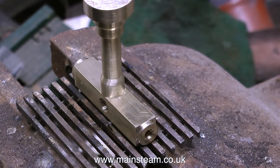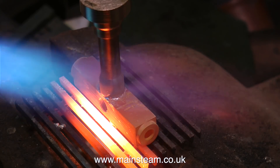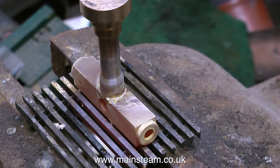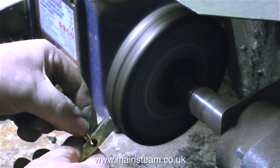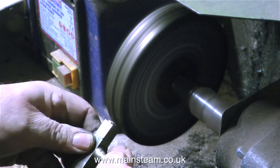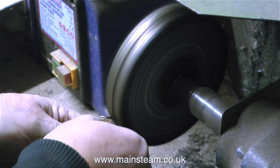In earlier clips you've seen the completed turret — this is the silver soldering part, which I thought I would show anyway. If you need more information about silver soldering in greater detail, I have produced other videos on the subject. In reality, this is not the neatest silver soldering job I've ever done, but in the outer part of my workshop where I do the silver soldering, it was very cold on that day so I just wanted the job out of the way. Once I let the part cool to black and quenched it in some water, I cleaned it up on the polishing spindle. I didn't bother putting it in the acid bath as there wasn't really a lot of flux residue on the part anyway.